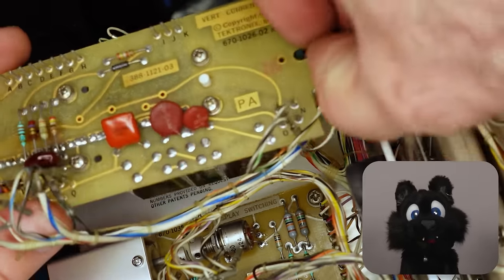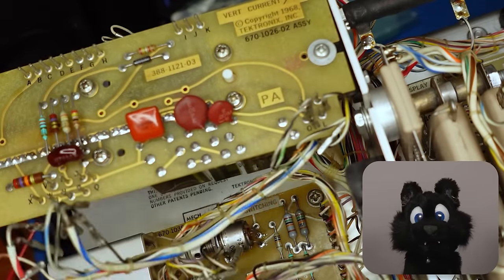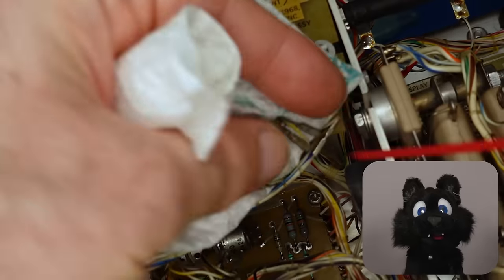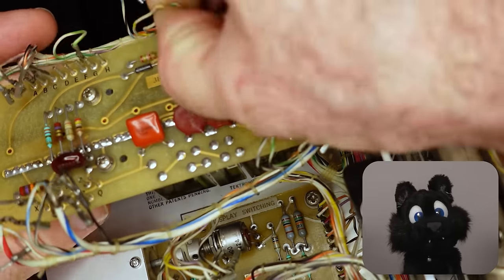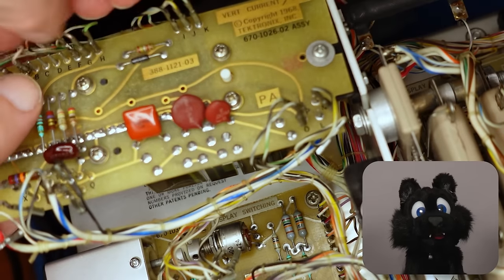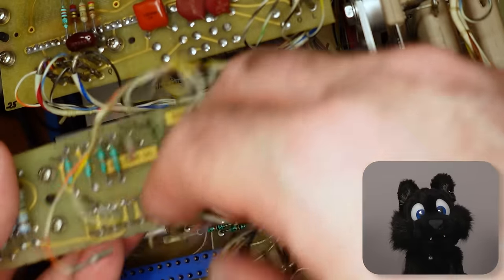And now, adding the attenuators. I choose this way because I thought it might be easier to attach the front panel when all the switches are already in place again. Note that I keep the mounting screws loose until I can tighten down the front panel mounting screws first to avoid any stress on the components or switches.